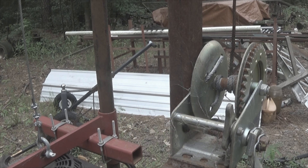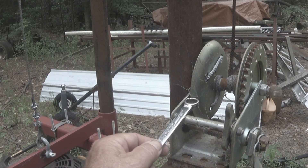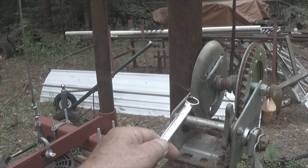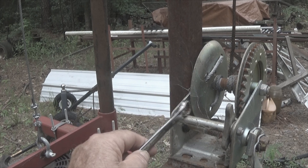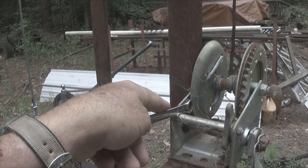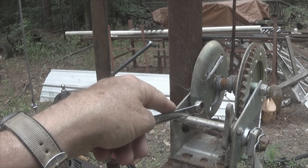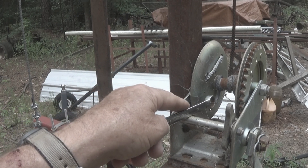It comes with a 6-inch drill head, which will allow you to sink a 4-inch casing. I bought a 4-inch bit because I was running 2.5-inch casing, and that allowed me plenty of space.